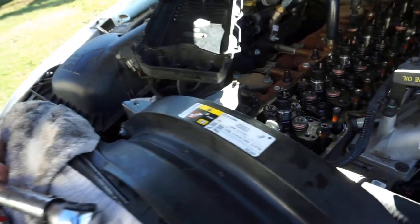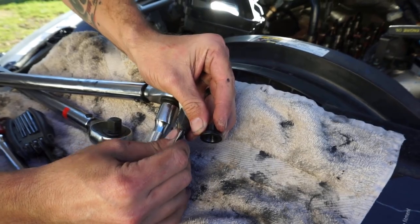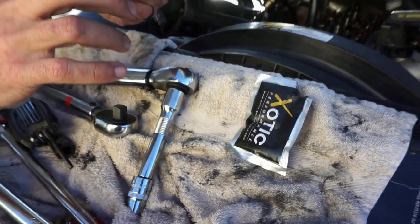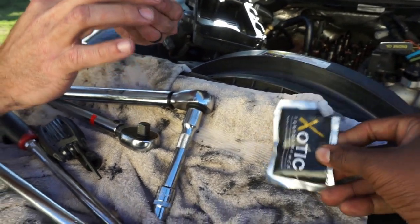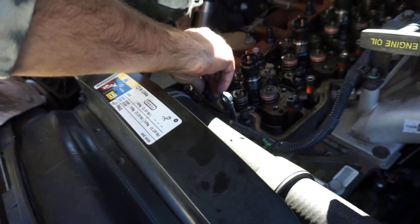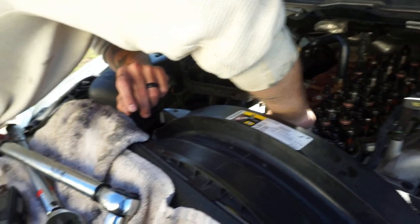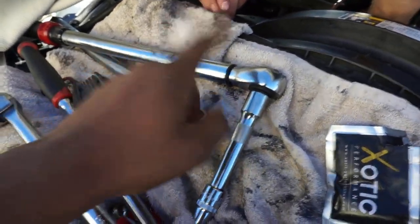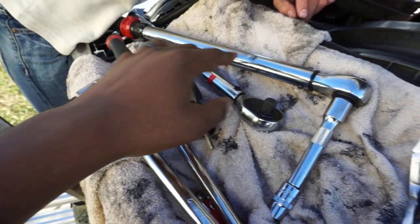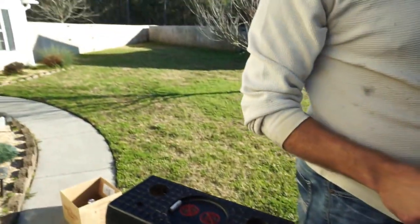They provided plenty of lube too. You don't need a lot — this stuff goes a long way. We used maybe half the packet. You don't need it all slopped up, just enough to cover all the surface area, same with the threads. He's burning it down and then going to torque: 40 foot-pounds, followed by 80 foot-pounds, followed by final torque 125 foot-pounds. We got two torque wrenches which makes it quicker — the longer one set to 125 for better leverage, and the short one we go back and forth between 40 and 80.